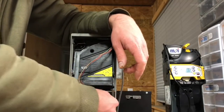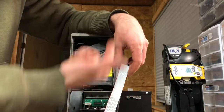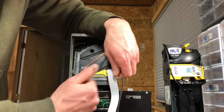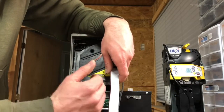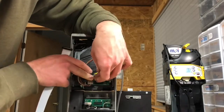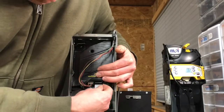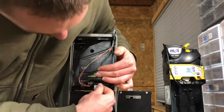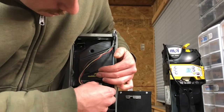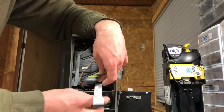Remove the harness off the sensor board as gently as you can. We want the harness to come down off the connection when we plug it into the acceptor board, and we want the red line to be on the left-hand side, just like the white line is on the left-hand side on the old harness. So plug it in very carefully — make sure you do not miss any of the pins and that you get all the holes lined up. Plug it in gently; they're really small holes and you don't want to prematurely spread apart the pins or damage the insides of the connector like happens on the old ones.